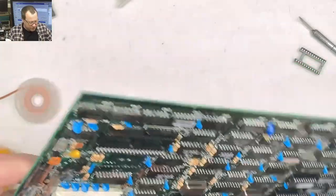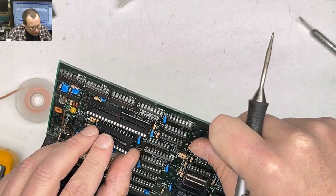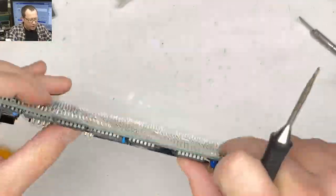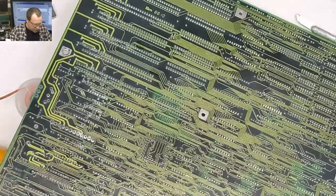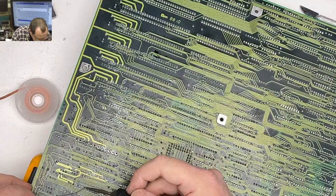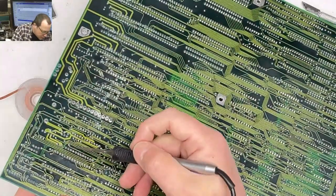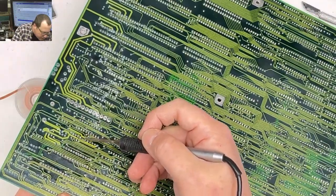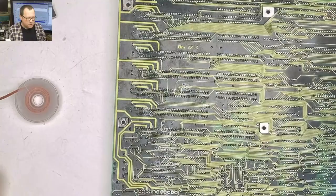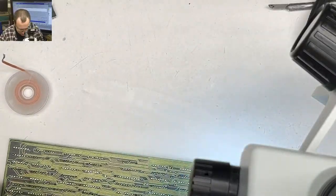I think all of our vias are cleared up. Let's see if this socket goes in there. Excellent. It's almost like it's an actual 24-pin socket there. So not janky. Again, gonna press up and make sure it's sitting flat. Okay, so the sockets are aligned. Let's do some rapid fire soldering under here. Go back to the microscope.